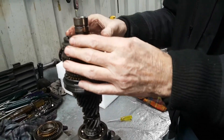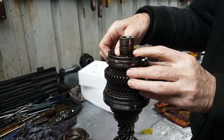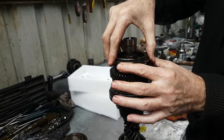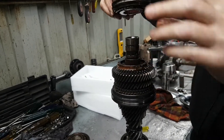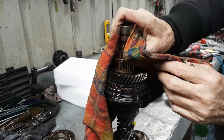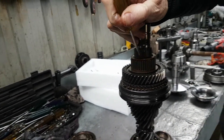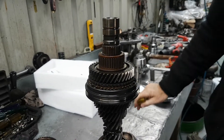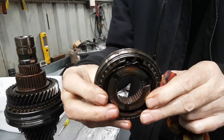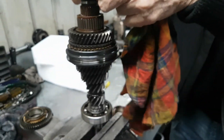The actual problem with the box is this play here. As that slider goes over the gear while it's turning, there is play — wobbling. If I pull this off and have a close look at the spline, look down at the bottom — you can actually see the step. On the inside you can see how thin that spline is, and at this end you can still see the good part of the spline, but up here it's thin. That wobble is creating the problem.